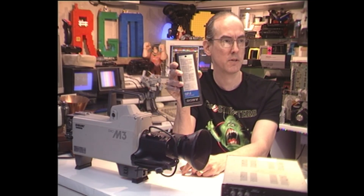Well I think that's just about the end of this video. I hope you've enjoyed watching - I certainly enjoyed making it. It's been a very interesting experience, a little bit disappointing at times, but I got through it in the end. I persevered and the camera we're using now has gone from being completely useless to working again. My methods aren't the best - I'm not recommending anything that I've done. I was very lucky on this occasion. So if you're thinking of buying one of these old broadcast cameras, the infrared filter is certainly something to think about. Which camera did you like best? Myself I do prefer the tube cameras - I love that warm glow you get, and I also like the trails, which you don't get with a CCD. Of course one of the downsides to a tube camera is if you point it at anything bright like the sun, you will burn the tube and get a black line on there which will never come off. Also if you leave the camera on the same image long enough you will get screen burn, something that's quite common with CRT based products and some plasma TVs.